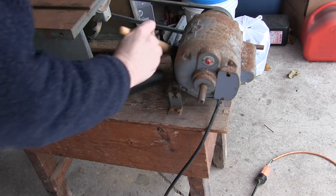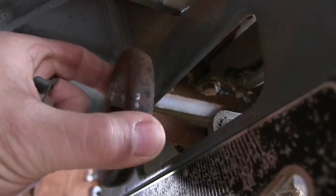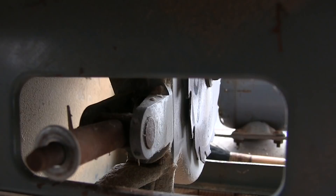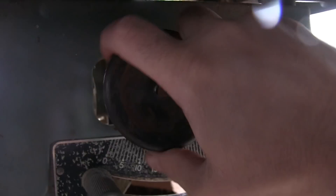This is the adjustment where you raise and lower the blade itself. That's not nice. I'm going to take all this off so I can get in there and spray some PB Blaster on those threads and hopefully loosen them up a little bit. I'll give it a good coat. Oh yeah, that's like butter now. The more you work it, the better it feels. Oh yeah, that's nice.